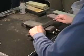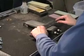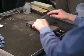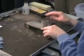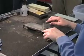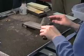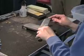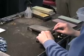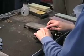Just to here, knife tip, whether I'm sharpening on a belt grinder or whatever, I really say that's the best way to do it. I think there are some people who actually do quite a bit of this type of stuff when they start from the tip, and they do really good work on the tip. It always looks pretty. But I just don't see how you can start off and control it and find an angle that way. Maybe for a quick kind of stropping or something it works, for a little polish. But to start off with grinding it, I just don't see how it could work. Do it however you want. There's no right or wrong way.